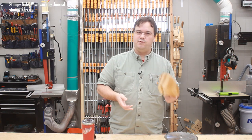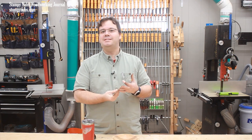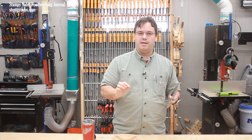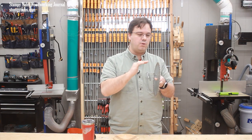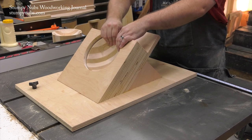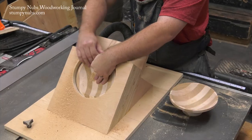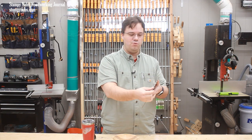To determine if the risk is reasonable or reckless, we have to first ask: what could go wrong? Some folks believe that the saw blade was not designed to withstand pressure on the sides of the teeth, and they worry that a tooth could break off and become a projectile. I don't agree with that assessment. You aren't cutting with the full side of the tooth — you're taking shallow cuts that only engage the top corner of each tooth, and you're not applying that much pressure. Here I'm turning this bowl by hand; I can feel how much pressure I'm putting on the blade, and it's not that much. I'd compare it to pressing as hard as I can with my thumb on the side of a tooth, and there's no way I'm going to snap off a carbide tooth with that level of pressure.